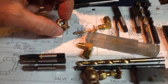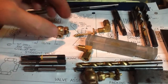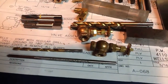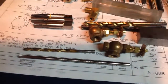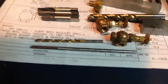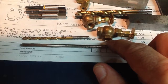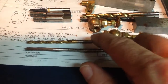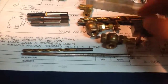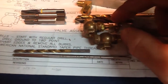The second thing is, it says to drill, and as we all know, the drill doesn't make a perfect concentric hole. Luckily I found a reamer that's 3 thousandths bigger than that. So if the 5/32-inch drill is about 156 thousandths, the reamer I found is 159 thousandths, which happily made a nice concentric hole. I'll be using that for all the valves I make. Here's a couple of the finished valves.